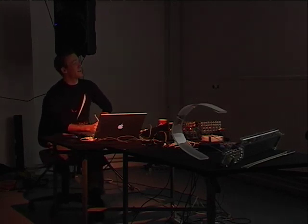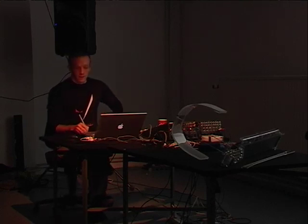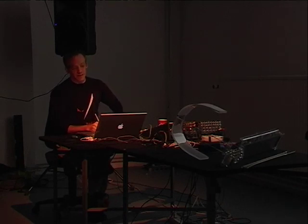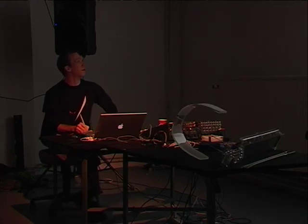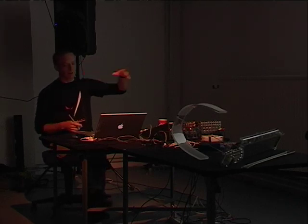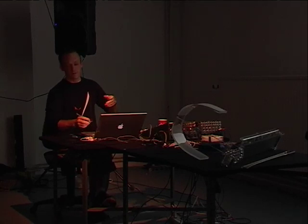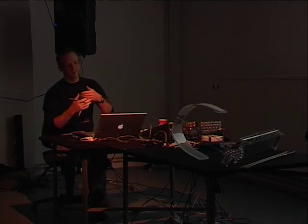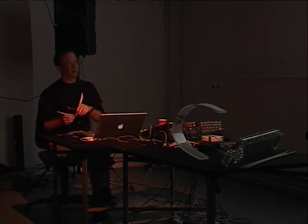So basically what happens after you implement that is you've got all this jitter from the transport and we recover a constant delay. So now we have a delay, but at least it's not random, or it's not as random. I have some papers that describe how that works, and it's very technical, and also very experimental, but this is something that we hope people will become more aware of as an issue with microcontrollers, especially when you look at Arduino and stuff like that.